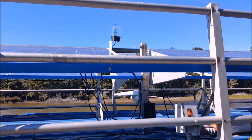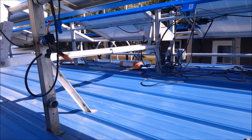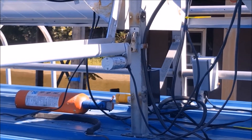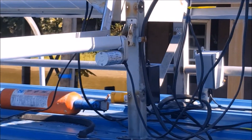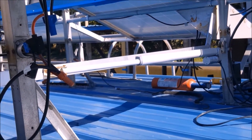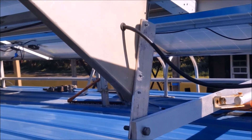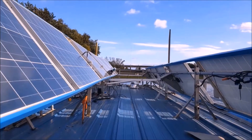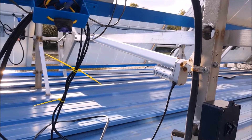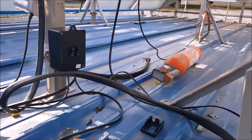The number of controllers I use inside the boat — I think there are three or four now. I've got different-size inverters installed: a 3000-watt and a couple of 1000-watt. The batteries are arranged in two or three banks separately in different storage areas; they're acid-type marine batteries with lead posts.